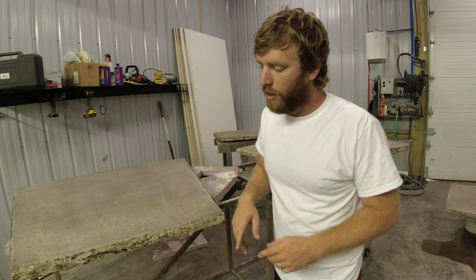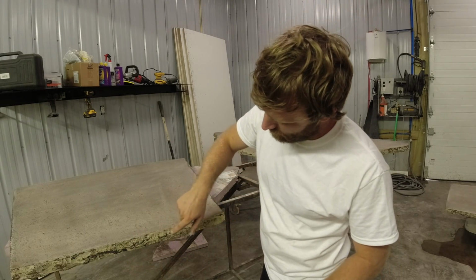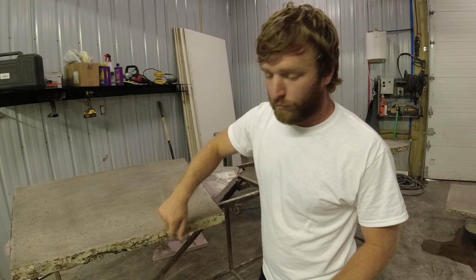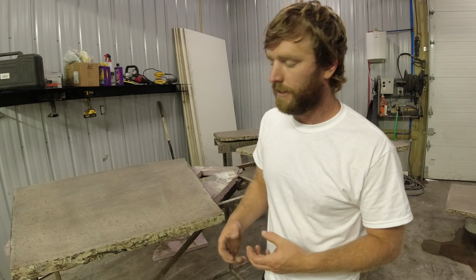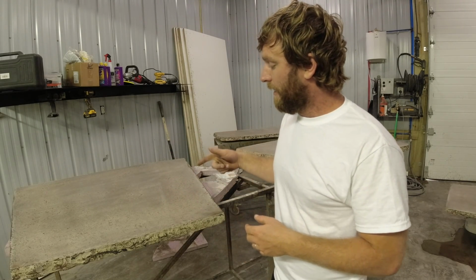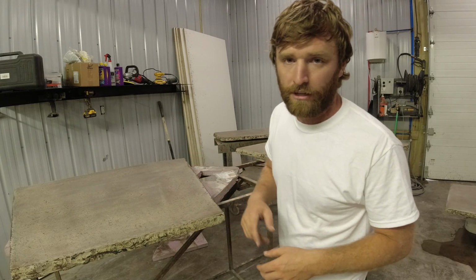before you seal them. And if you noticed, I didn't do the face, and the reason is because this is still very porous. You still have a lot of rough surface for that sealer to bind onto, whereas the top is completely polished smooth, very little to no open pores. So that sealer needs all the help it can to make sure it binds. And wiping them down like that, making sure it's clean, is the best way to do that.